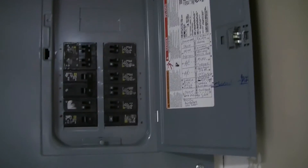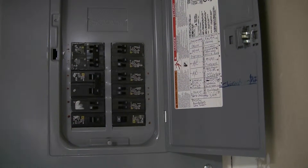I found those when I was bringing down three new circuits myself. Me and my electrician buddy are going to separate out the microwave, the furnace, and the kitchen refrigerator. About three or four feet above this is a metal junction box we found buried in the wall with some 10-3 on it, which actually is a dishwasher and disposal feed — should be 12-3, but they ran 10. They junctioned it and hid it in the wall, so I basically just exposed it and left it accessible.